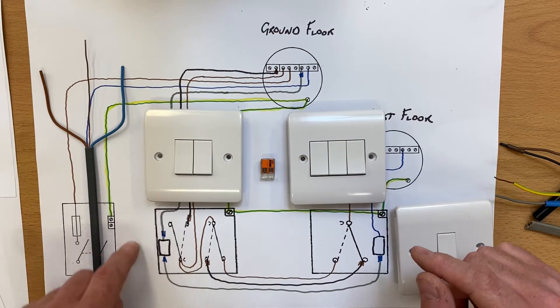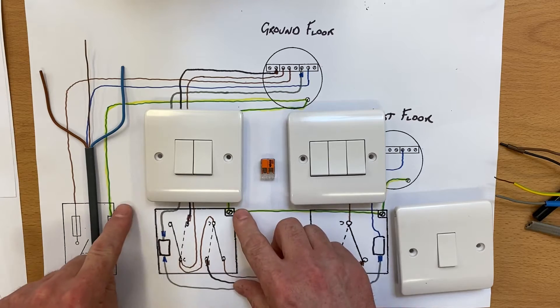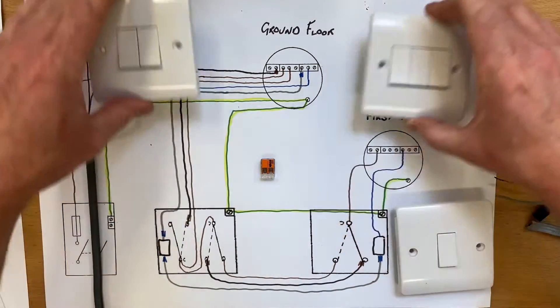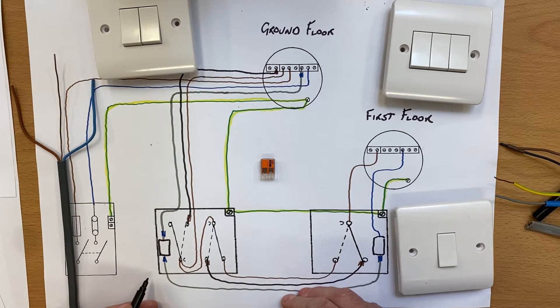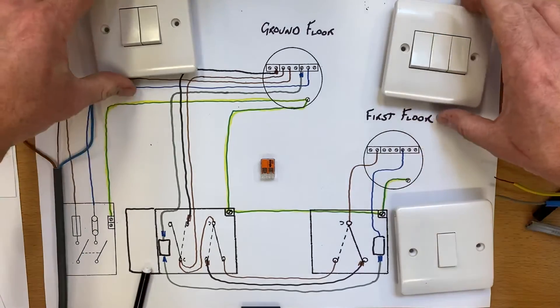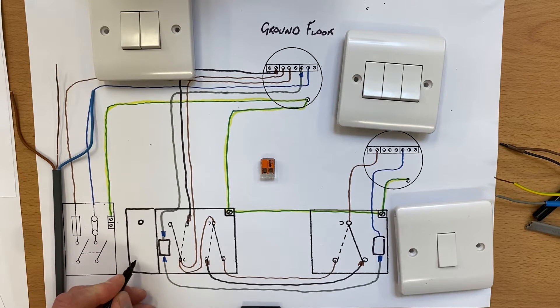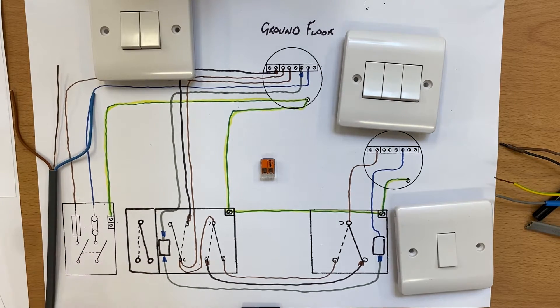What I'm going to do now is just bolt this onto the side here — I'm going to draw a little bit extra on here rather than re-stick another piece of paper. I want to show you how we could have those connections and actually go to another switch which would control the outside light. I'll extend the switch slightly — the two and three-gang switches are physically the same size — so I've added another gang to that switch. I want this one to be my outside light.